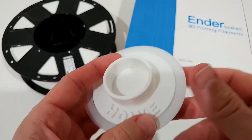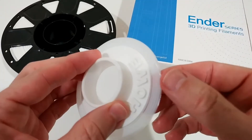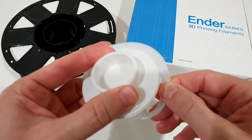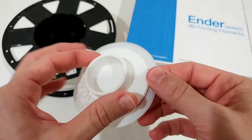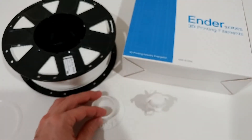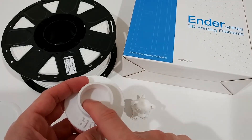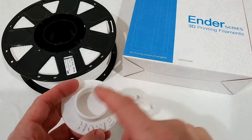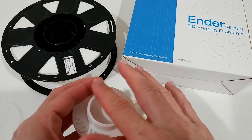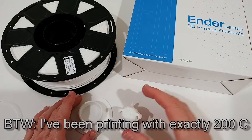You can see the light mirroring — absolutely flat. It stuck nicely; the corners and edges are absolutely perfect. I don't have to sand or do anything. I can just remove what I call 'the glue' — it's not real glue, just something printed on the hotbed to help adhesion, but here it wasn't even needed. You can see how easily it comes off, much better than with the old filament. Overall the result is very, very good. It's also waterproof — this is a drinking bowl for my daughter's hamster and it works really nicely.